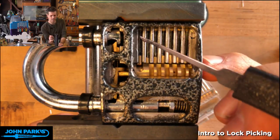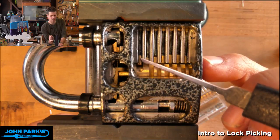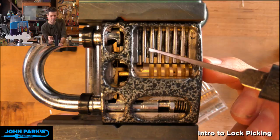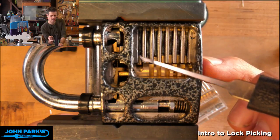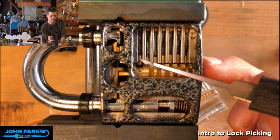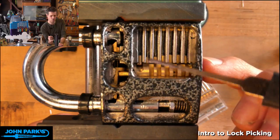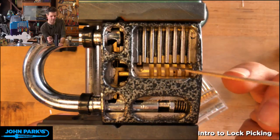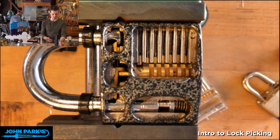The key doesn't reach that one, and it's sort of an interesting design choice. But I've seen a lot of locks made this way, where there's in this case a 7th pin that's not for picking. It doesn't need to move. It's just set down into a little channel, keeping the lock cylinder from popping out. It probably just makes assembly easier, actually.